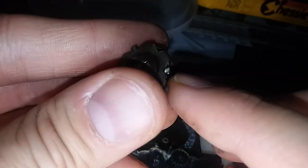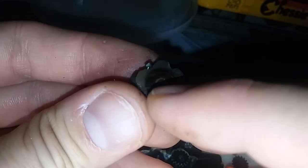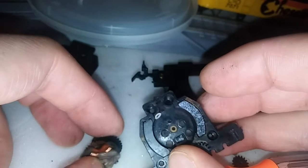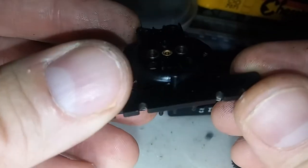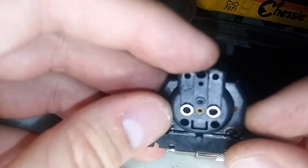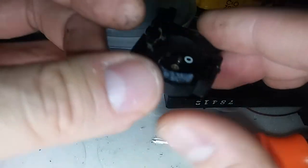You can see here where the windings are supposed to be — these are shiny. You can see where this got hot, where it kind of burned a little bit. It literally started to melt through it right over here. Now if we take a look at the shell — you see all this plastic should be flat on the top and it's all kind of burned out. It melted here; it clearly got way too hot and burned right through it. Oh, here are the two brushes. These are what the brushes look like. So it's understandable what happened — someone tried to fix this and it literally melted the top through. This motor got that hot and actually burned through the commutator a bit.